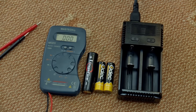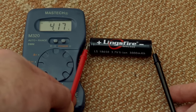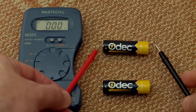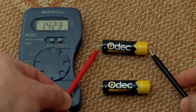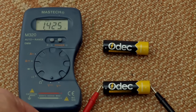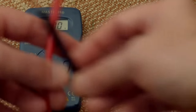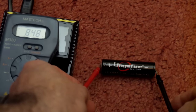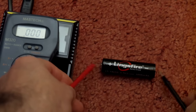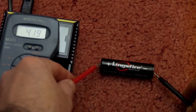Running a quick charging test — the lithium cell came out at 4.17 volts, which is okay but slightly under optimal. Normally you'd expect 4.2 volts, so it's not too far off. The nickel metal hydride AAs came out at 1.42 volts, where normally I'd expect 1.45 to 1.5 volts — so it's slightly undercharging on NiMH. I ran this test a few times with different cells. Now using the Nitecore D4 to test the same lithium cell, I'm getting 4.19 to 4.2 volts, so the D4 gives a better charge, albeit not by much.